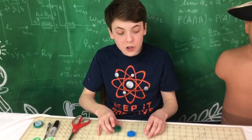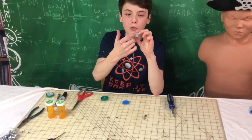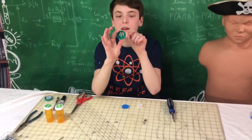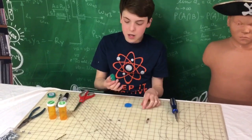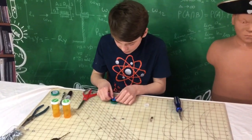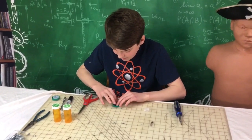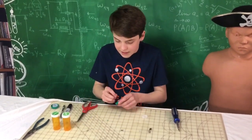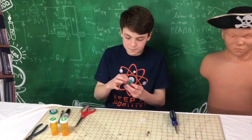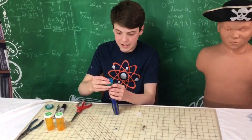Now we're gonna make our little valve. Take a small cap and a big cap. Take a small drill and put a hole through the little cap, then put a hole through the big cap — this is so you can put a screw through both of them. On the big cap, put a few larger holes around the outside. Then take a little bit of a nitrile glove — those plasticky gloves — and push it through. You could put a little hole through first with a pin. We did try things that weren't nitrile gloves and they didn't work — transparency slides and other plastics were too stiff. What worked best was the nitrile glove, the really thin stuff.